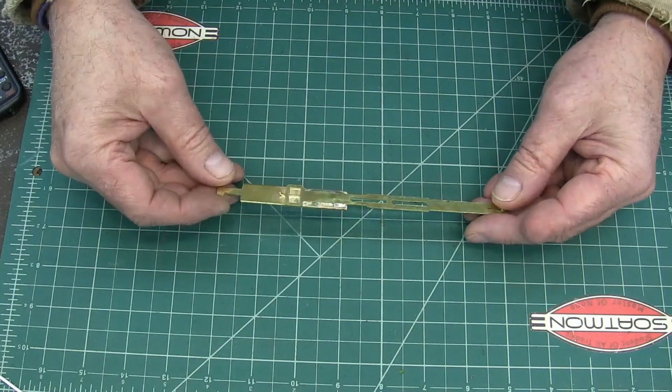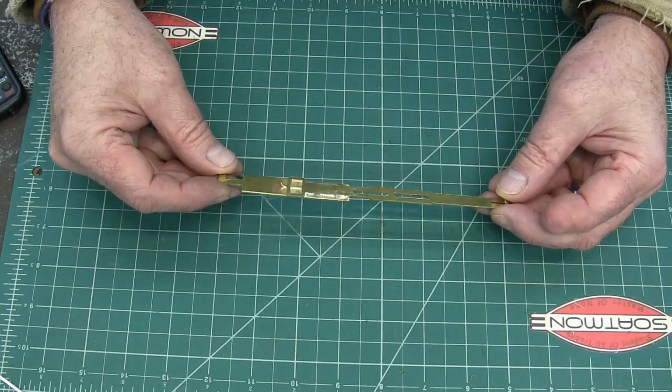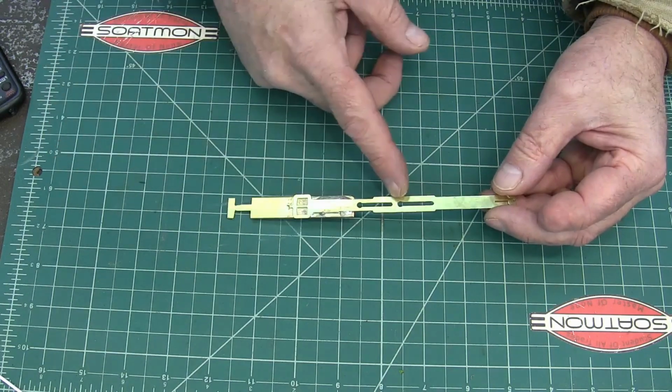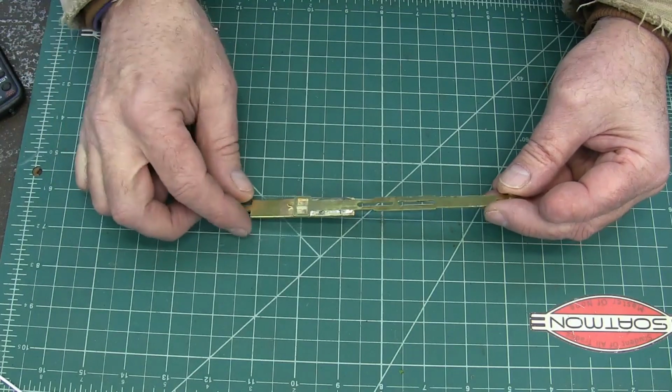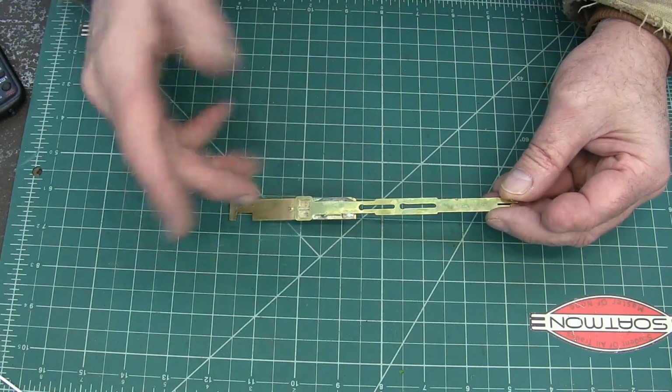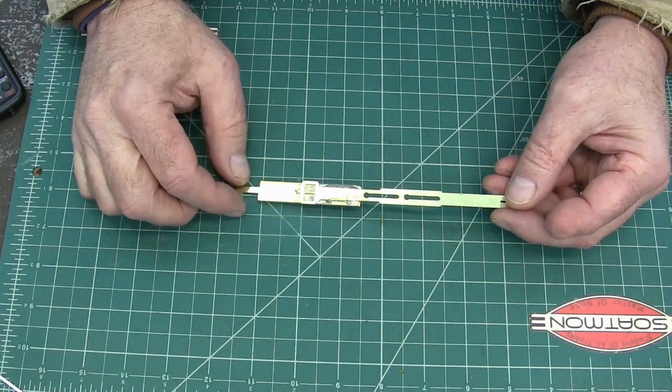Now, I looked online to figure out how do you lengthen a pendulum when you need to, and I couldn't find anything. So I thought, well, this is brass, and I've got a little brass lying around, so I can just solder it together, and it's reversible. If I need to, this is just plumbing solder, so I can reverse it off of there. So anyway, I'm going to hang it on the clock now, and we'll see if it keeps better time.